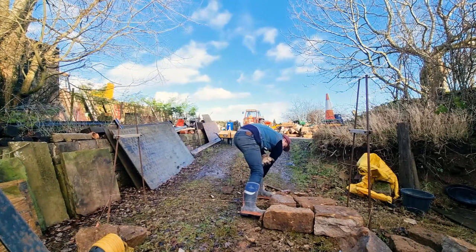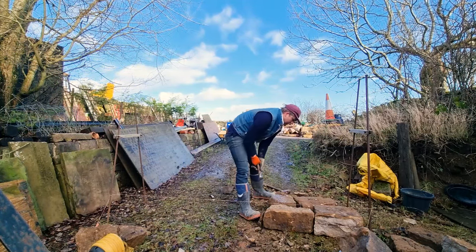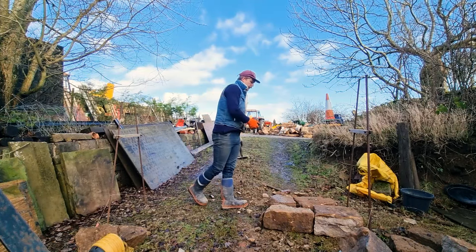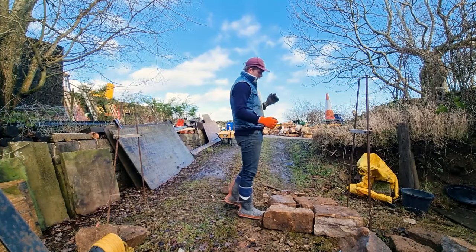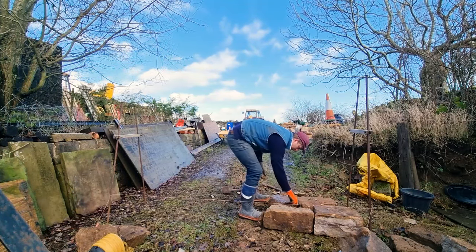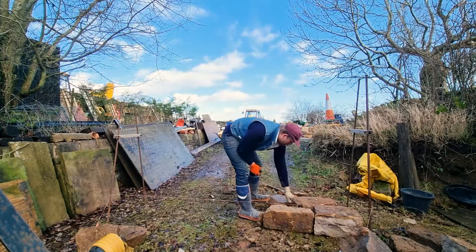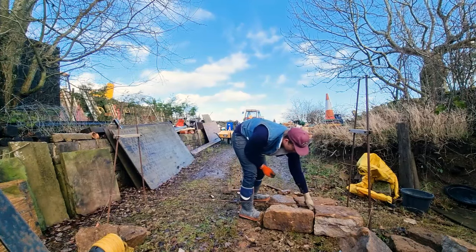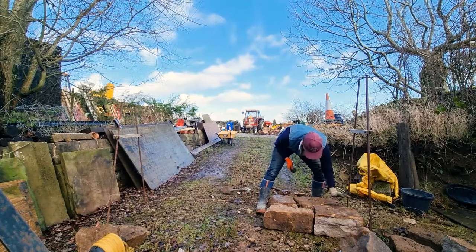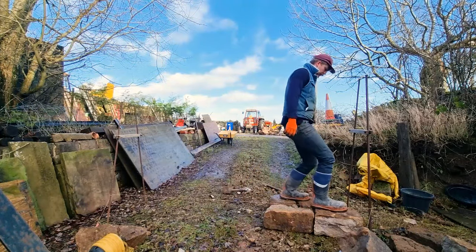So yeah, what I've just done there, the decision to prioritise the tightness inside, that is how I wall. Face, it's important, but it doesn't always come first. I'd rather get the inside structure looking good, and then, if you know what you're doing, the face is going to look good anyway. But you just know that your wall's going to last a lot longer. You know, it's bloody satisfying.